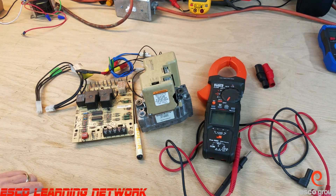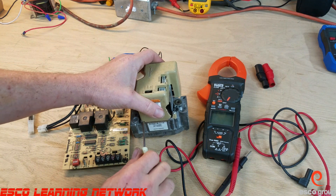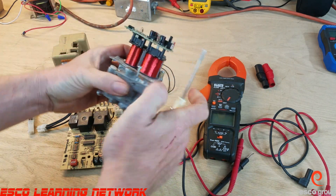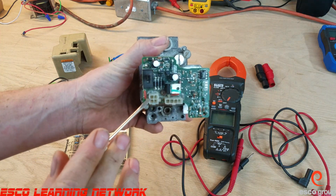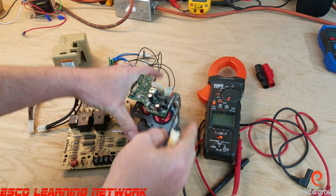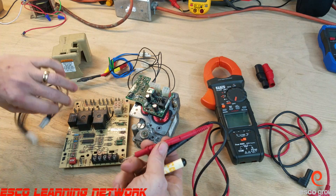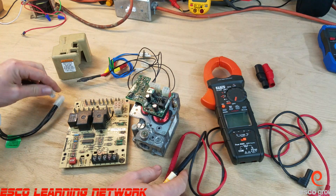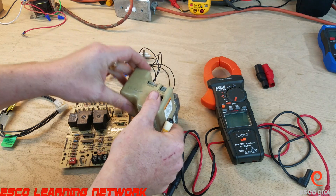Without damaging any of the pins or plugs or things of that nature. So just a quick review of what the smart valve is — don't try this at home, you'll damage and break the valve. The smart valve is a gas valve with a pilot valve coil and main valve coil. We've got two plugs here on the top: this one connects to the IFC, and this rectangular one goes to the igniter. We're very tempted when testing and diagnosing to jam our meter leads into these things, and we may damage the pins, or even damage the harness. This harness that connects the IFC to the board is not really replaceable, so if we damage it, you're in a bit of a pickle.